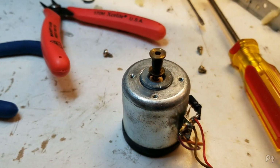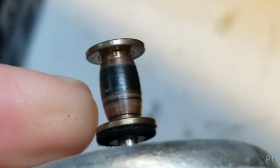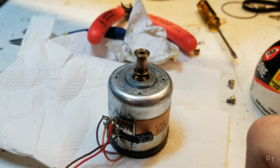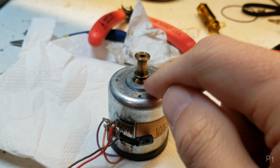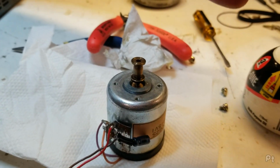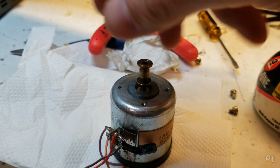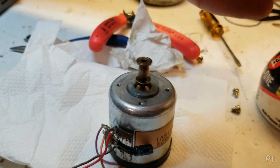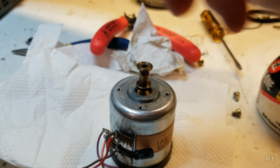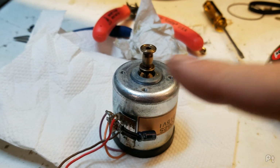It's a little noisy. Lots caked on there. All right, cleaned off the black crud and got some new oil down into the front bearing. I don't know if it sounds quieter, but it definitely free spins more. The back bearing is all riveted closed, I can't get to it, so hopefully this is enough.